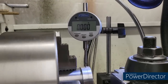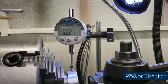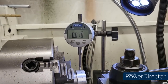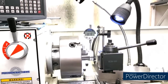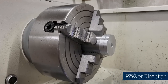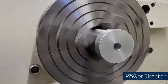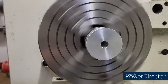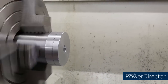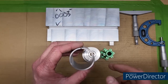How did it do? I zeroed it — worked absolutely perfect. Simple, effective workholding. It's loaded — I just took it off the part. Good stuff. I forgot to show you how true the bore ran, because that's pretty important since we're doing a bearing pocket on this side. The OD, the face, and that bore were all cut concentric to each other before we did the workholding. That's how true it's running — there's a little chamfer there so that might throw you off a little bit, but it's running true as true can possibly be.